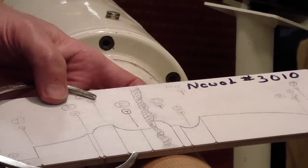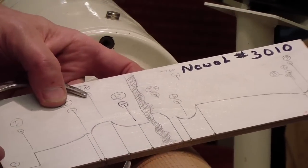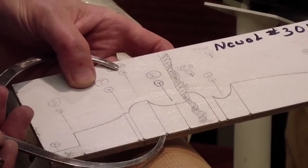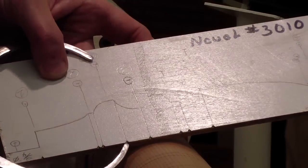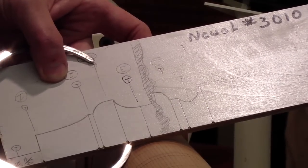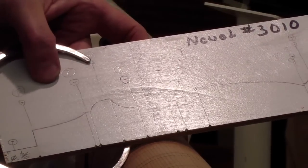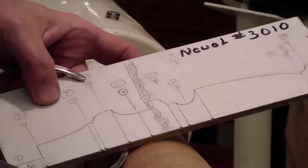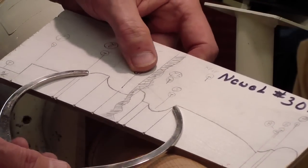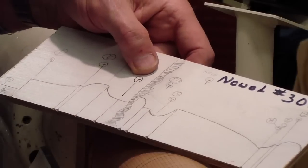So now, I can even do this on television. I can anchor on the bottom side, and I'm solid. Now I can anchor on the bottom and adjust my caliper until it's where it belongs up here, which is real easy compared to trying to watch both sides at once and make sure you're right on a full-scale drawing.